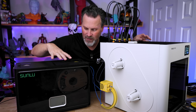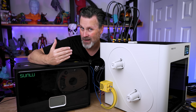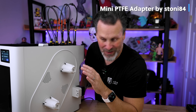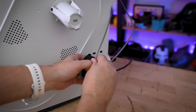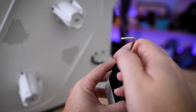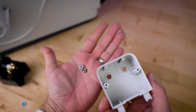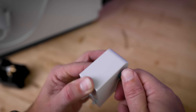Unfortunately, because the U1 loads filament on both sides of the printer, I haven't found a convenient way to use a four-filament dryer like the Sunlu S4, unless you're loading it above or below the printer on another rack. There's also another even easier PTFE mod — just two small discs — where you unmount the feeder off the side of the machine, remove the two bolts, pop out the metal insert, and replace it with these printed inserts. Just make sure you don't lose those metal inserts if you ever want to reverse it.